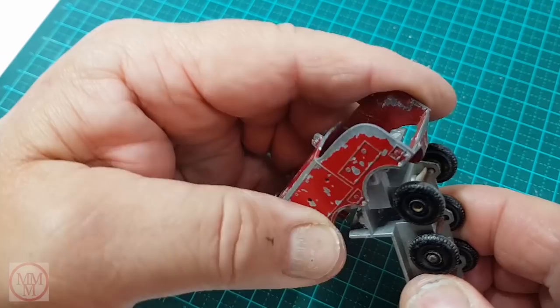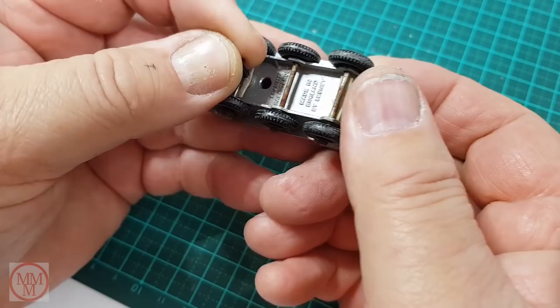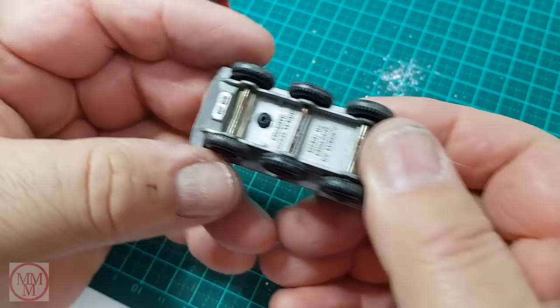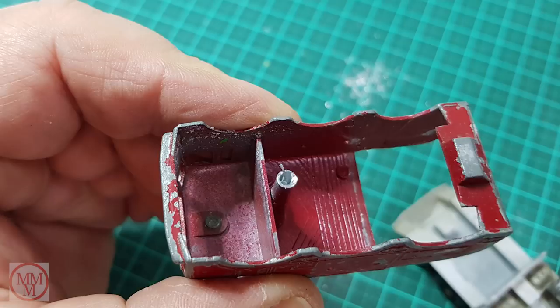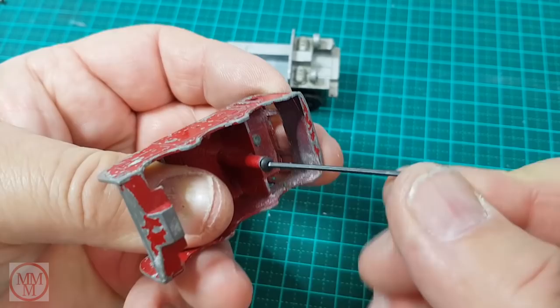It's an unusual casting this one, in that half of it at the rear is inserted into the upper casing and projects from the rear — so it's rather unusual. I'm just checking that I didn't drill that hole too big for this screw. It was a bit borderline but I think I managed to get away with it. I've threaded it with a tap and I'm just test fitting this screw which seems to go in beautifully.